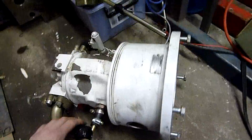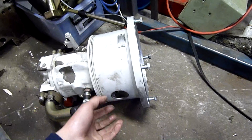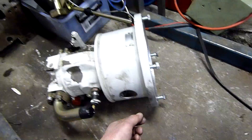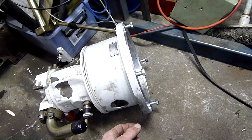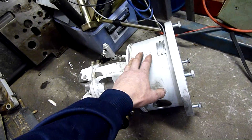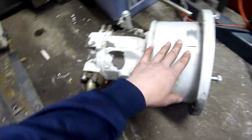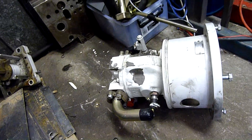To remove this, normally you don't take it out as a whole unit, but I got lucky — the cap screws captive inside this housing were jammed up enough that I could just spin the nuts off. Normally you'd take the motor off first leaving this in the machine, because the motor's more commonly a consumable item, or you'd take the pump off and separate that.